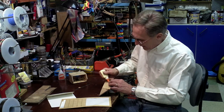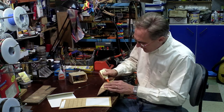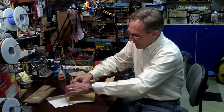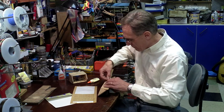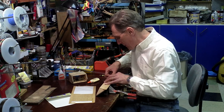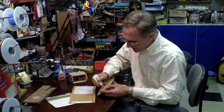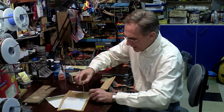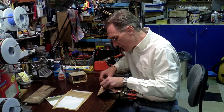I can just show you here what I'm talking about. I just take my little glue container and lay a very thin bead right across the top, take one of my rows of shingles off the paper — and as you can see it is a self-stick product — and I lay that course right down on top of that bead and right on top of the other piece of shingle. Make sure that my lines line up, and it's done. Then I start again, lay a thin bead of glue down, take the next row of real wood shingles, and lay it on following the next line.